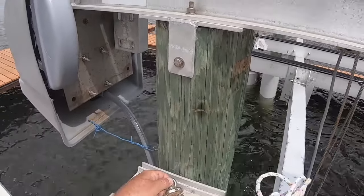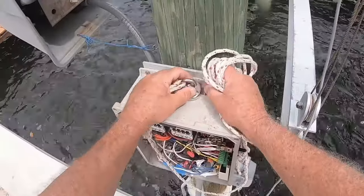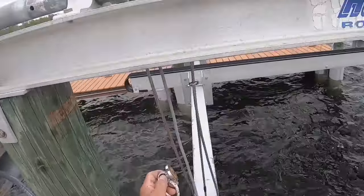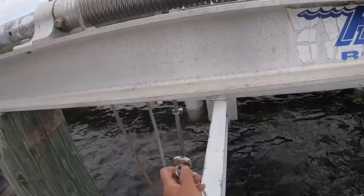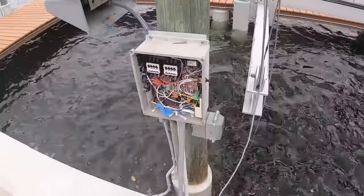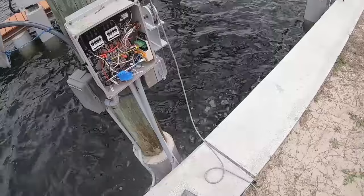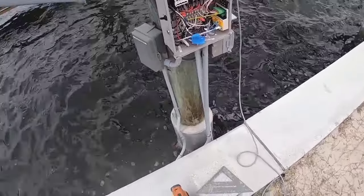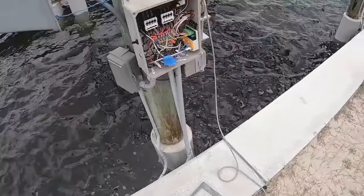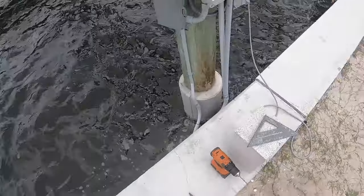You see, stainless hardly has any magnetism. The 304 has some, but not much. And 316 has virtually no magnetism. So that's how you can tell what grade of stainless you have. There is virtually no chance that I could pick that up with a magnet. Sometimes, if it's a steel piece, you can pick it up. And this is a really strong magnet. But when it's stainless, you can forget it. It ain't coming off.